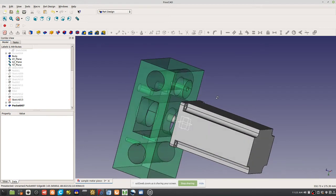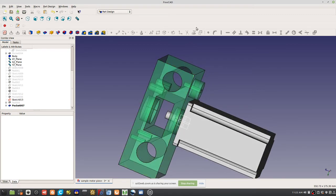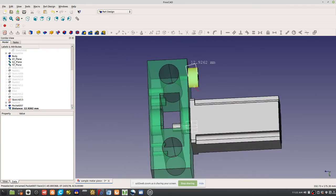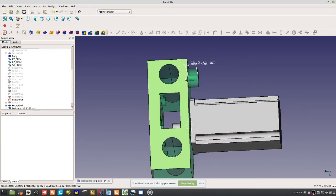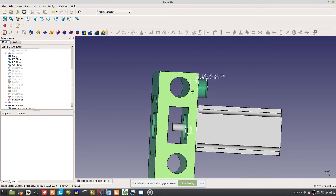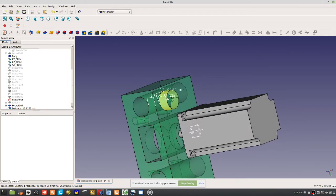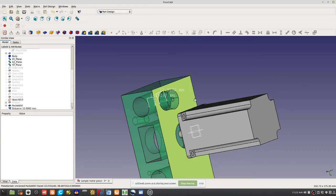The clamp force of all the threads, well, can our M6 by 18 do it? This looks more than 18. What is that distance that we need there? What kind of screw size will fit there? So we've got 12 millimeters, like in this particular example, plus 10 millimeters. So we've got 22 millimeters. Well, our M6 by 25 would pinch down on there. So imagine you have 25 millimeters of thread catching into plastic. That's a lot of strength. That'll be a very forceful set screw. You can use our bolt with an M5 hex drive, the M6 bolts we use.